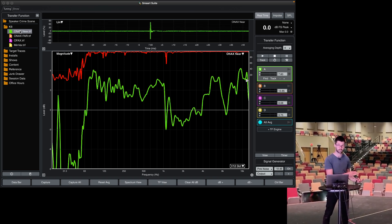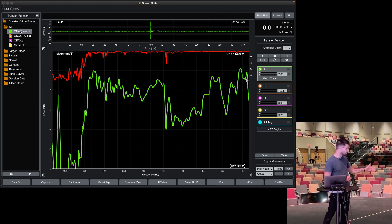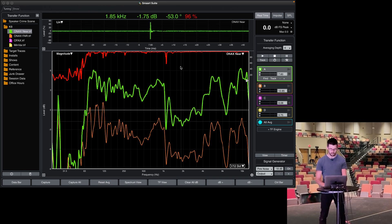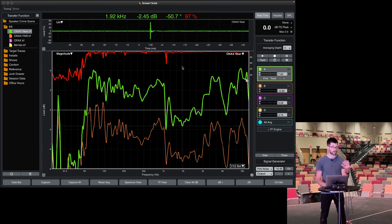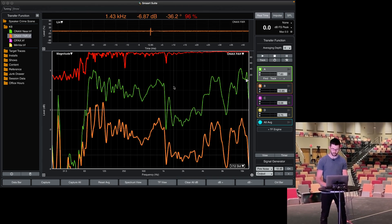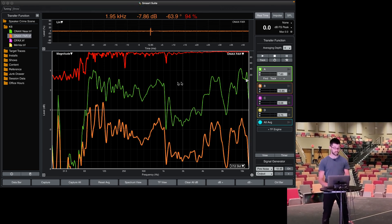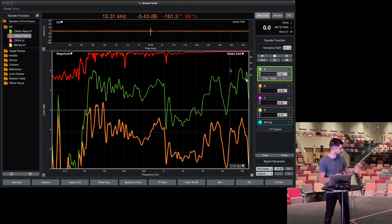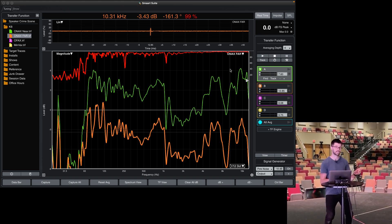That's our on-axis far measurement. If we're familiar with the inverse square law, it means we're going to lose half our energy for every doubling of distance — and that's what we have here. We're doubling the distance. So let's look at this trace and see if it is indeed half the level. If I put my cursor here right at 2K, I can see it says negative 2.5 dB. So looking for a 6 dB drop, I should be at minus 8 to minus 8.5. Selecting the orange trace, we're here at negative 7.86 — not quite minus 8, but we're seeing across the entire board, all frequencies, a halving in level. This is a law of physics we can't escape. If we move double the distance from a reference point, we're going to lose half our energy. That's on-axis near versus on-axis far.